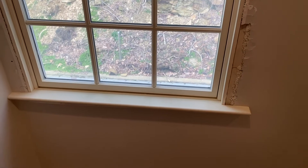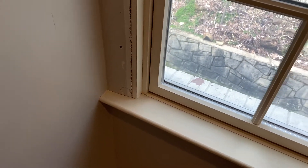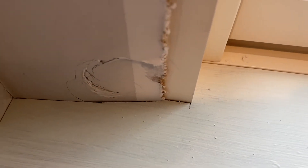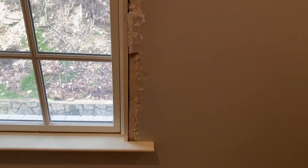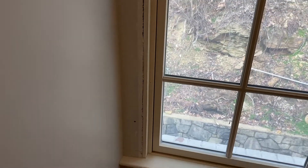I got the stool ready to be nailed into Grant's window and it was a tricky fit. This wall is a little bit short so I didn't have room for the full stool - I had to cut the end of it off, but it had to fit nice and tight. Also this wall kicked out a little bit in the corner, so I had to fit it tight against the jamb and then wing it out to match the contour of the drywall. On the other side, the drywall was sticking out so I had to do a stepped cut. I got the rest of the drywall massaged with my mini sledge and we're ready to go.